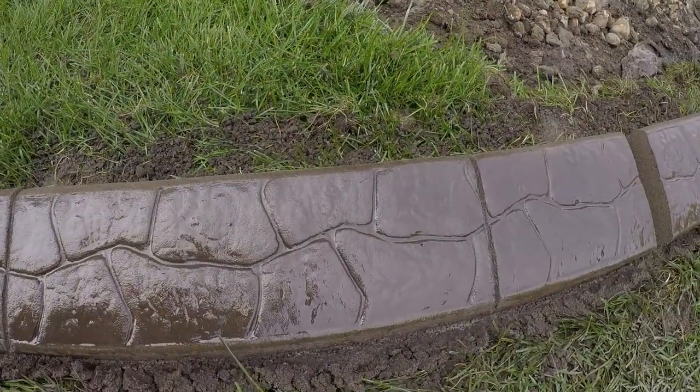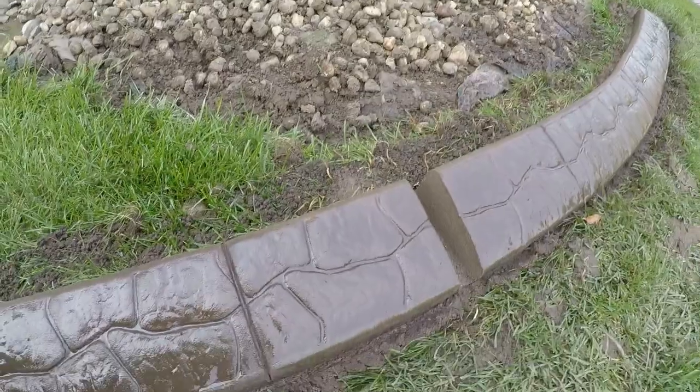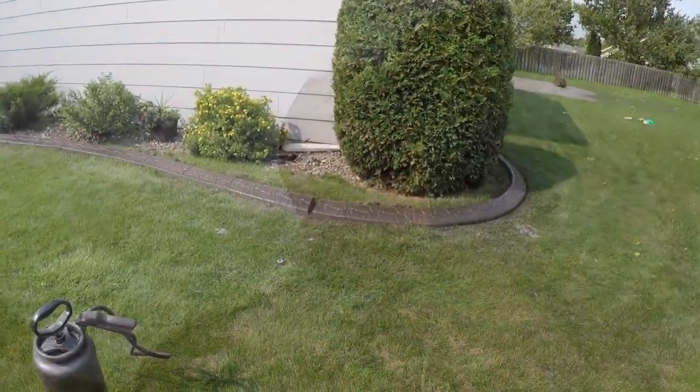The homeowner is here, and this is a good time to show them what the actual color is going to be. You have to remind them that this is going to be really dark, especially for a couple of days depending on the weather, because there's obviously moisture in that concrete that needs to evaporate through the sealer. If they come home and say it's really dark, just relax and let them know it's going to lighten up. The dark colors will stay dark, but those light colors underneath need to lighten up. I liken it to dumping water on a sidewalk — that spot is darker because it's wet, and when it evaporates it lightens up.